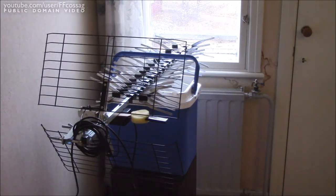The reason they're able to amplify a signal in this manner is because they sacrifice omnidirectionality for receiving a signal coming from a single point in the distance. In order for a TV antenna to work, you need to aim it in the right direction, in my case the direction to the nearest cell phone tower.